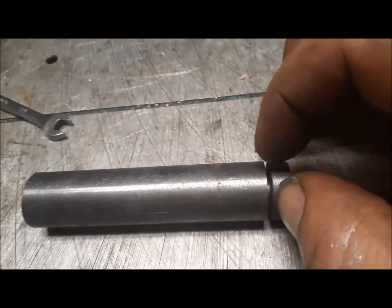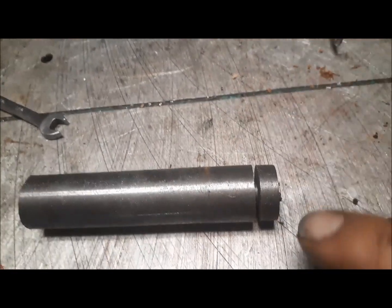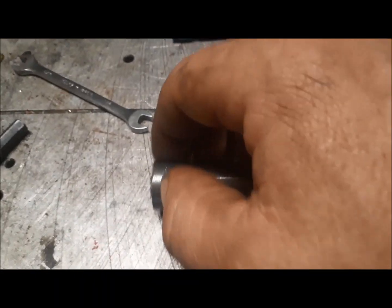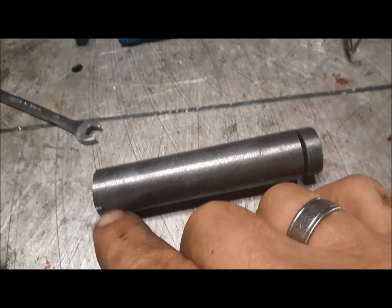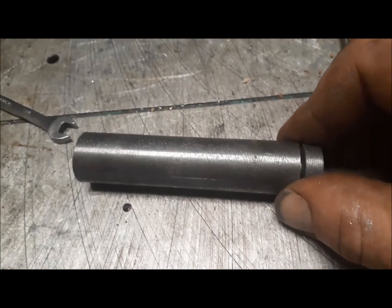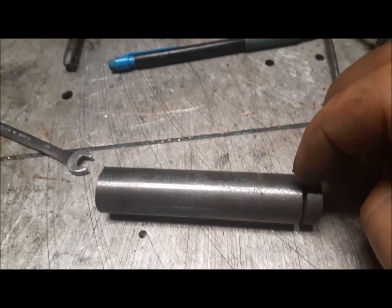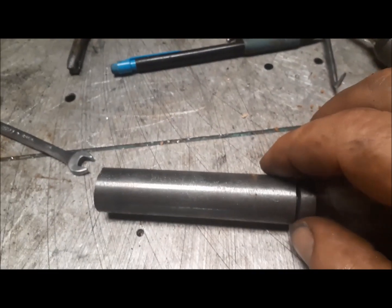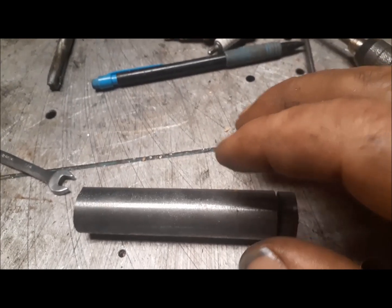So I have this piece of cast iron, and this is going to be my cam lobes and the two thrust bearings that I need for the camshaft. So I cut one thrust bearing. I didn't center bore it yet, but it'll get a center bore. I'm just going to take the other thrust bearing off this end, and whatever's left is what I'll make my cam lobes out of. I will make sure to draw a line down the side of this, and that's where the set screws will go. And that also tells me how far to do my offset in the four jaw chuck. My offset will be 3/16. So I guess you could say it'll have a total of 3/8 stroke, but obviously only half of that is being used as a cam. So the idea is to have the rocker move 1/8 of an inch. So I'm going 3/16, and that gives me a little bit of leeway.